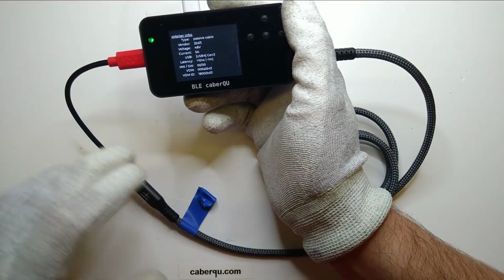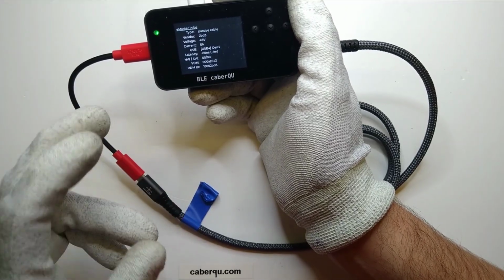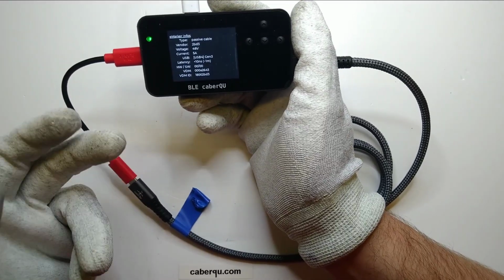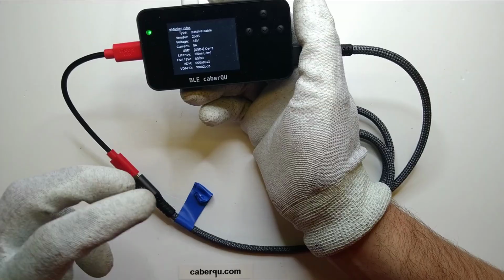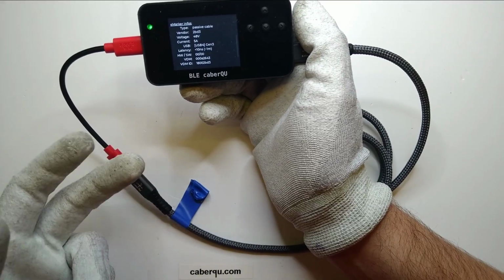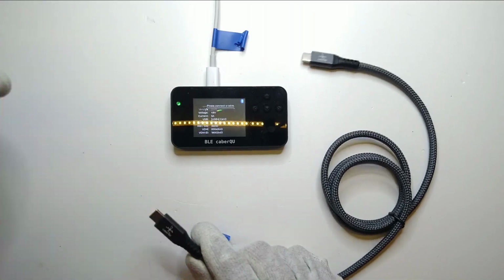They are not part of the standard, so there's no way to get yourself recognized as one. But you could theoretically act as a one-port USB-C hub, so just the worst kind of hub, where you have one connector and one socket. That would be technically feasible to be recognized, and then the power delivery negotiations could switch through accordingly, where the lowest current and lowest voltage of both devices would be used to charge whatever device you're connecting to it. So nice idea. The attack vector is definitely there, but something tells me that they didn't fully think this through.